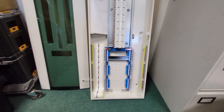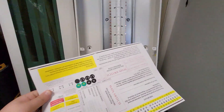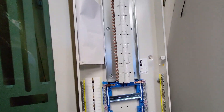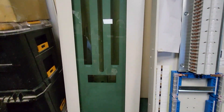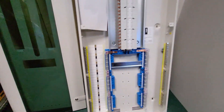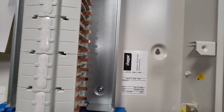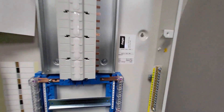We'll jump to the desk and have a look through the instructions. This is the labelling kit you get with it — obviously we won't be using that, we'll be doing all of our own labels anyway, but it's nice to see they do come with some labels. The spine board is pretty consistent with the whole Hager range. You'll see it's got the glass door there and the nice opening for the SPD kit and main switch. You can see in there that it is dielectric tested at 3.4 kilovolts with an earth bond test and it's been dated, but that test hasn't been done yet.